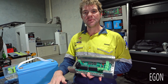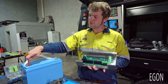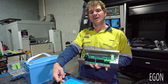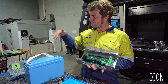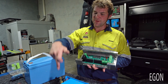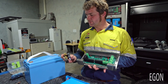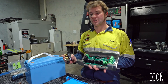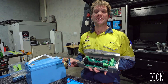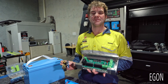This means you will have a fuse from battery positive on your house battery to the battery positive on your inverter. On the negative side, you can either go directly from the negative to battery negative on the inverter, or if you are using a shunt, please go to the load minus on your shunt and make sure that the cable from battery minus to negative on your battery is large enough to cope with the current going to your inverter.